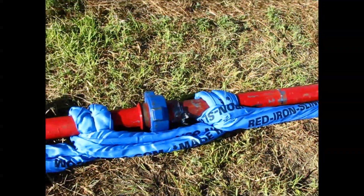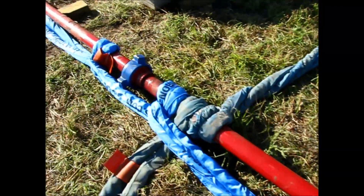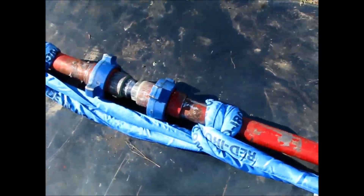If you notice, we have this restraint half hitched on each side of every hammer union. That seems to do a lot better job than your rib and spine. We've never had a half hitch pull off of a fitting.